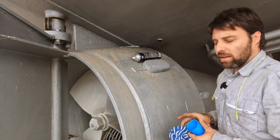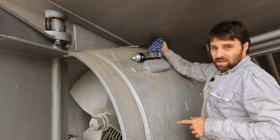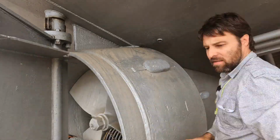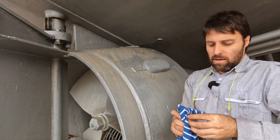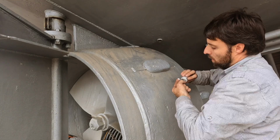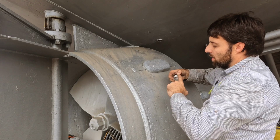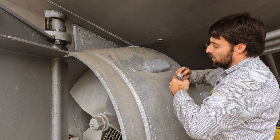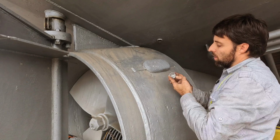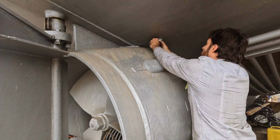This is just brake clean, just so that I can try and get the surface actually spotless for the thread sealant. Same deal on the bung. We get one shot at making this seal up really, really good. In fuel systems, you want to use pipe sealant rather than a tape. Tapes can come loose, go into injectors and start really ruining things, whereas a sealant like this, there's no real molecules that are going to stick together so significant that they'll cause damage. It's just a safer way of doing fuel systems overall.